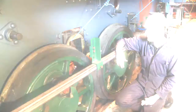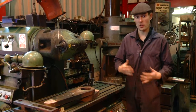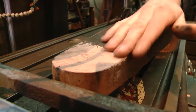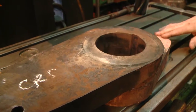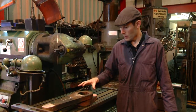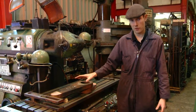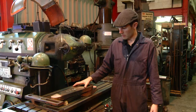The third focus of the overhaul is here with the brake gear. One of the important things about the locomotive is that it was very worn in the bottom end — that is, the motion, the brake gear, and other things. A lot of work is required here. On this brake operating lever you can see we've done quite a considerable amount of work — where originally the operating linkages were attached, we've actually filled these with weld, and we're going to machine them back, then re-drill, bore, and hone them to ensure they're back to the original size.